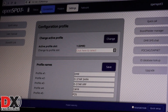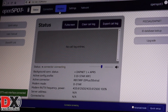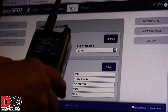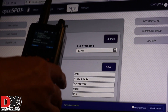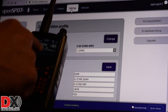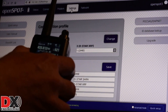If I go back to the status, you'll see that I am now set up for D-Star X-Reflectors. And if I go to Settings, the settings will confirm my active profile slot is D-Star X-Reflectors. It's having a little trouble connecting to the server right now, so I'm going to go ahead and change to a different profile. I have rooms 9001 through 9005 set up, and I'm going to go to room number 5 — transmitting just like into a D-Star room — which will be my P25 profile.